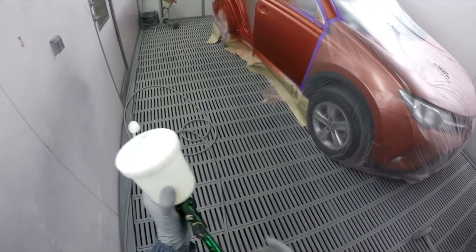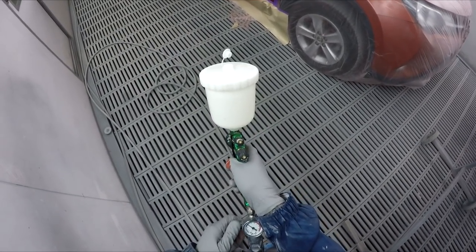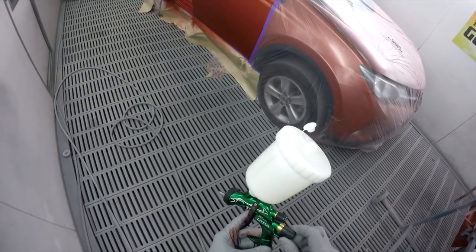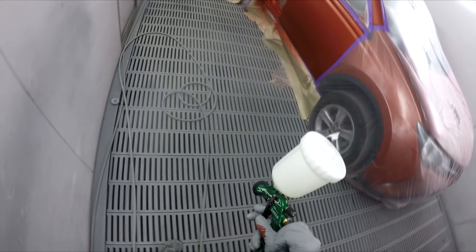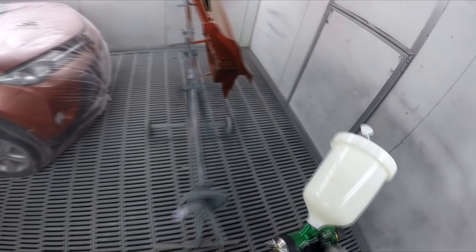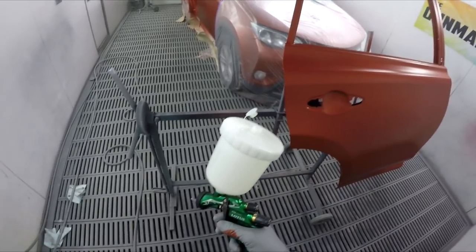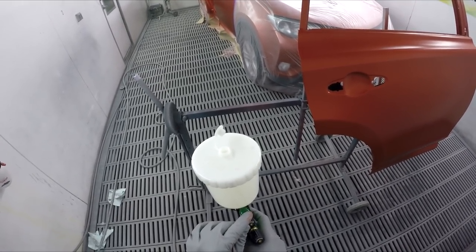He went right into detail as to why they made the fan so big. The long and short of it is: try these settings and it should speed the gun up quite significantly. Try it at 29 psi — so full trigger. You know when you're at full trigger when you pull the trigger and it starts pushing back; come out another quarter turn and you're at full trigger. As soon as you can wind it in and feel it pulling on the trigger itself — that's 2 bar, 29 psi. One and three quarter turns out on the fan. He said that should speed it up quite a bit.